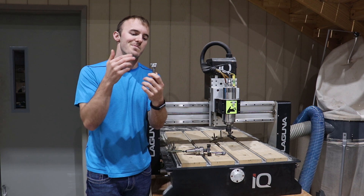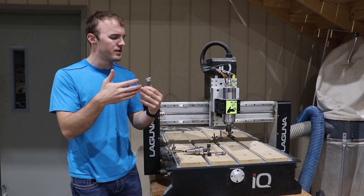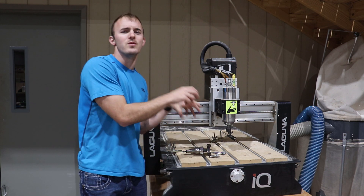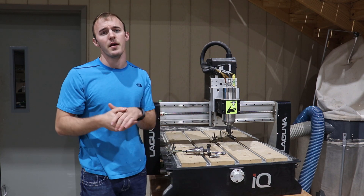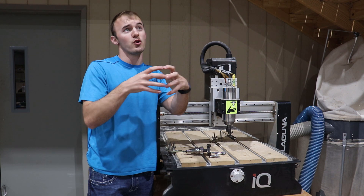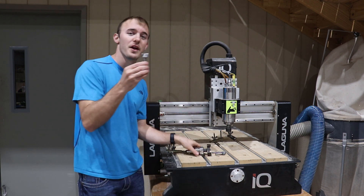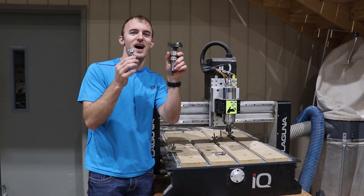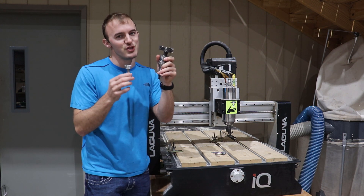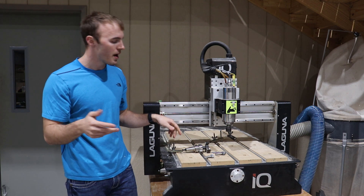I would stay in the one inch realm when getting these type of bits. They're almost a requirement, and you're going to see that you need it very quickly when you're first starting out. You'll need to know how to program it and utilize it correctly. Just because it's bigger does not mean it's going to be faster — and a too-large bit is also going to mess up your machine. Stick with something like this one inch surfacing bit. I have the link in the description below.